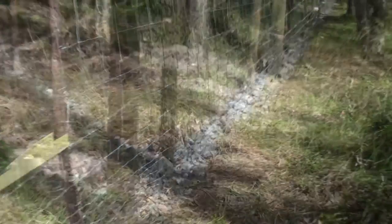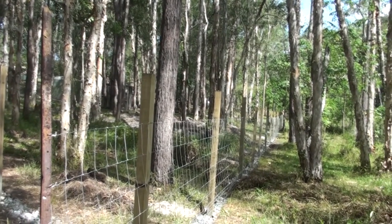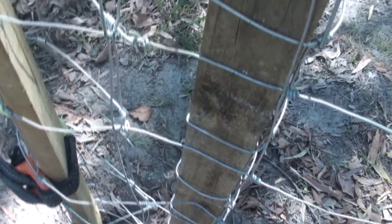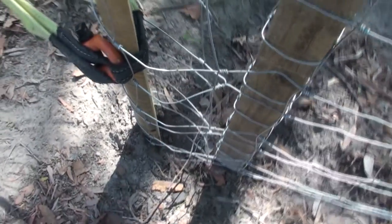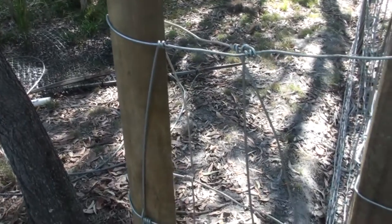There's the reverse angle on the pull and you can see the fence line goes for quite a way. Now, with the split log method, I didn't have to attach each strand to the log individually because the log just gets slipped down through a hole or a loop I'm making in the wire — I just tie it over itself. There's no need to really over-tighten it because the pressure from the winch is already more than you could manage by hand.